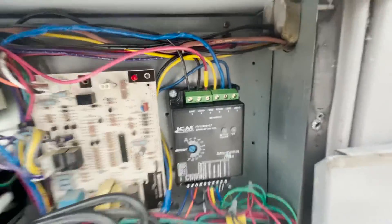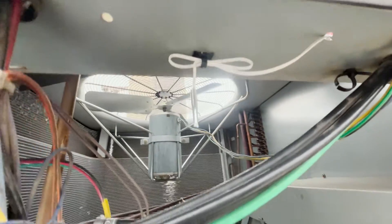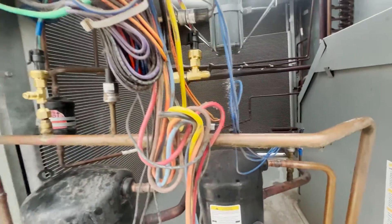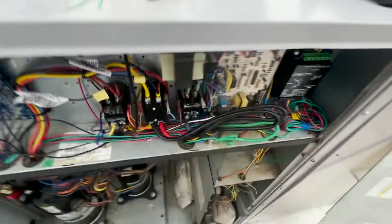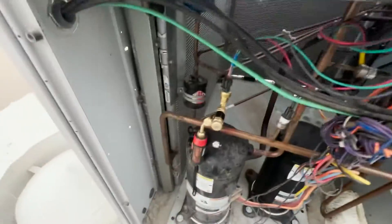I think we're there. A few more zip ties and we've got our ambient temperature probes strapped up with a mounting zip tie. We should double-check all of our stuff here, then put a set of probes on — one on each compressor — to watch these transducers and see how they perform. That's the ICM334. We double-checked all wiring, got our smart probes next to our new pressure transducers. Everything should be good to go. Let's give this bad boy some power.